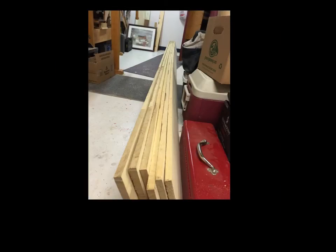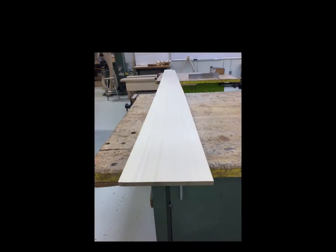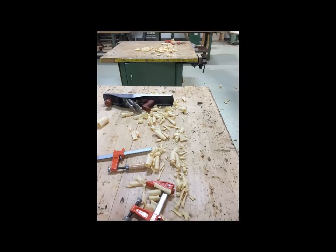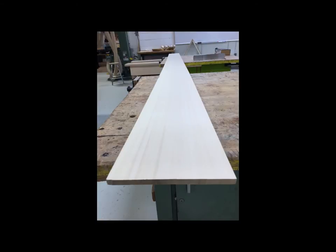This is a shot of six of them. After that we had to plane them down to the right thickness, which is about half an inch. I started with hand planing one side — that's the hand plane at the end there — then a bunch of shavings, and then ran them through the thickness planer down to half an inch. Beautiful looking wood when it's all done.